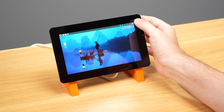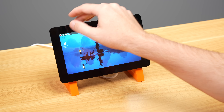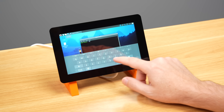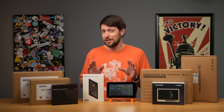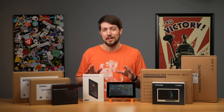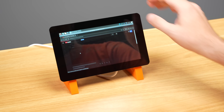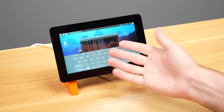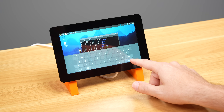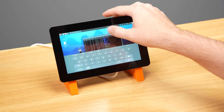You're not going to build an iPad mini replacement with this thing — it's not meant for that. PiOS includes an on-screen keyboard now, but you may need to enable it in Raspberry Pi configuration. You can tap the keyboard icon in the top right, or in some apps like Terminal it comes up automatically. Linux is not great with touchscreens, and even simple things like scrolling and right-clicks kind of work sometimes. The keyboard can even cover up what you're typing. For simple UIs like a Home Assistant dashboard it's fine, but for other interactions, not so much.